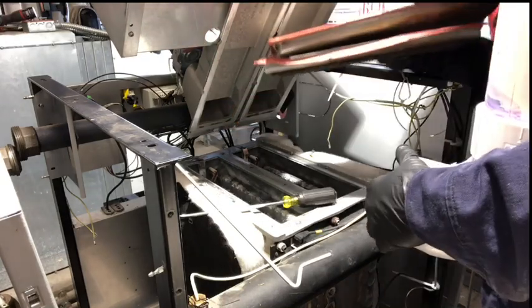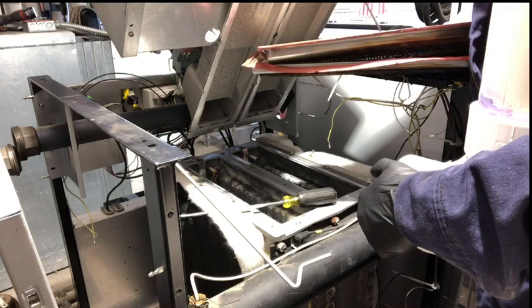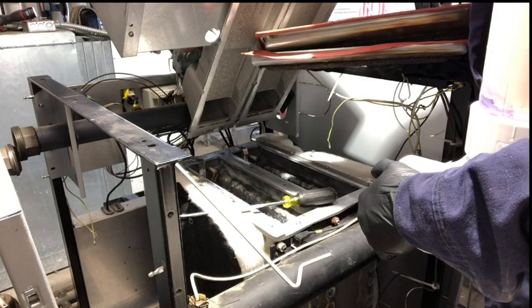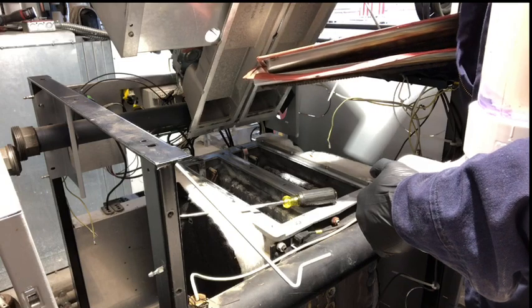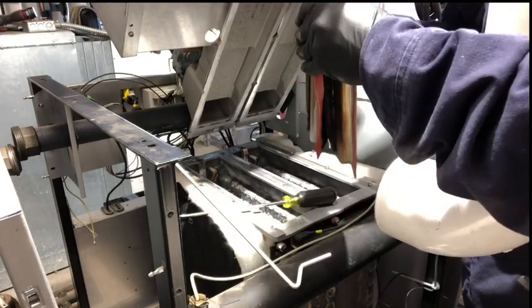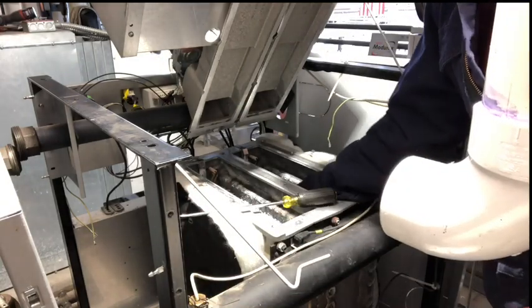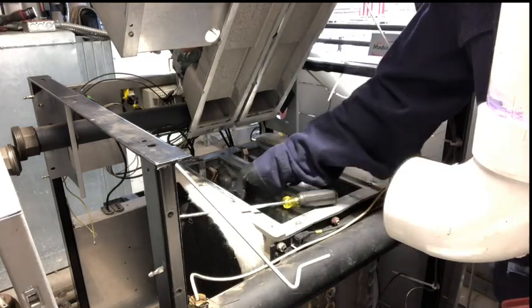As far as maintenance instructions go, they say if it's not a certain CO off of what it's supposed to be operating at, I'm not sure what the percentage is right now, that you don't need to tear them down. On the other side of it, they offer a 2-year maintenance kit, which is the Fireside kit. So I don't know which way to tell you to go, but I do believe in taking them apart and cleaning them, because even if they are burning right and the CO is correct, they're still going to get all this crud, deposit, debris build up in them.